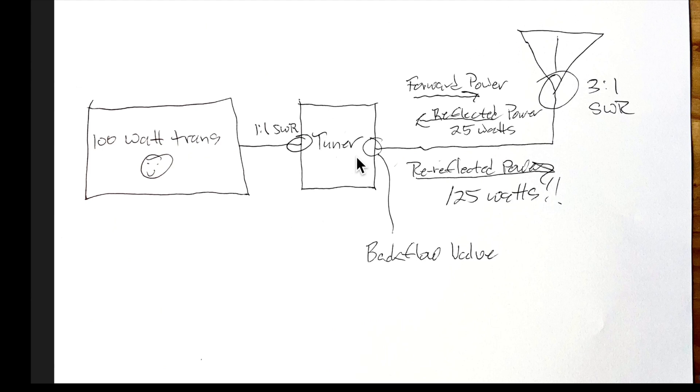It is obvious that this is what happens. Why do you think the tuner creates an SWR of 1 to 1 at its input? An SWR of 1 to 1 means no standing waves, therefore no reflected power. Reflected power never makes it past the tuner. That's why your transmitter is happy — it likes a 1 to 1 perfect match. Now, here's where we get the magic power increase. I'm going to quote the father of modern antenna and transmission line engineering, Walt Maxwell, W2DU.